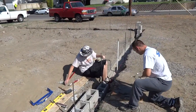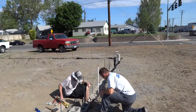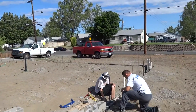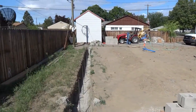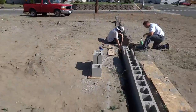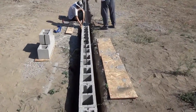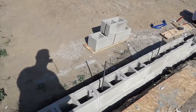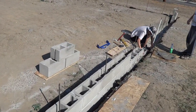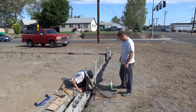Big Jack signing off from the Habitat for Hubler. This is step number three in building a house, which is the stem wall. Step one: dig your trench for the footing. Step two: pour the footing, and just before the concrete sets up, stick your vertical rebar in every four feet. Once it hardens up, build the corner, then lay the block. Later we'll come back and fill each of the cells that have the steel in it with solid concrete, and that'll hold the block down to the foundation. See you all on the next step.